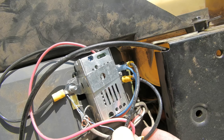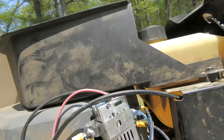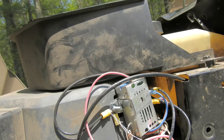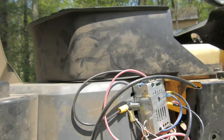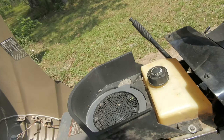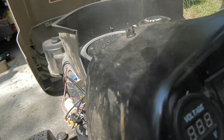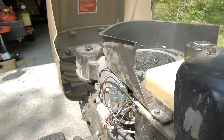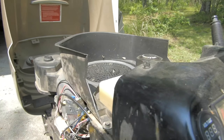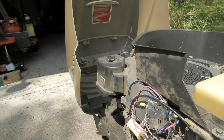Everything's kind of temporary. I didn't really make it so I can't go back — I can just unplug all this stuff. I may have to winterize it a little better, although it's pretty well protected really. So I may not do anything unless I have to. But it's working fine. I had it set for a constant 13.2, keeping the battery charged. It's at 12.6 right now which is a good charge for the battery, but I run it at 13.2 for the summer — that should be easier on the battery.